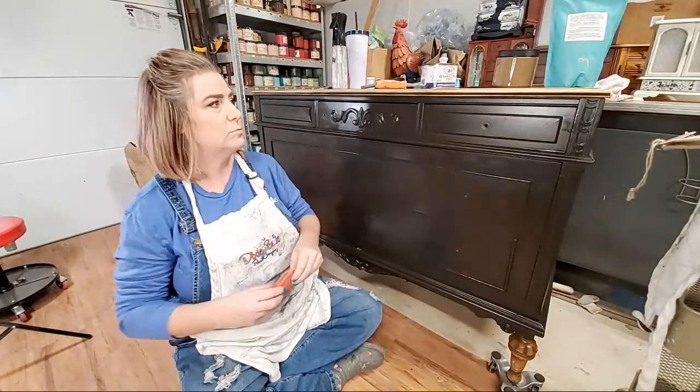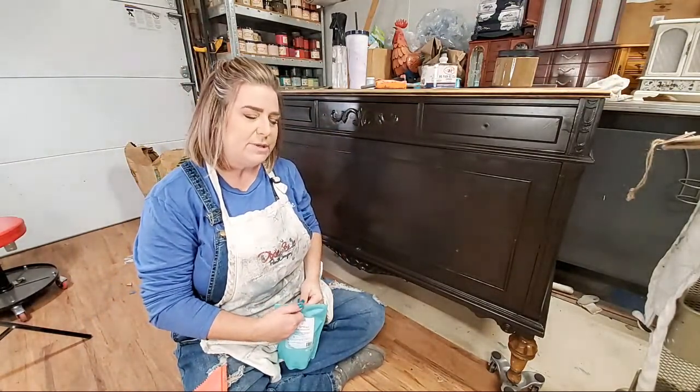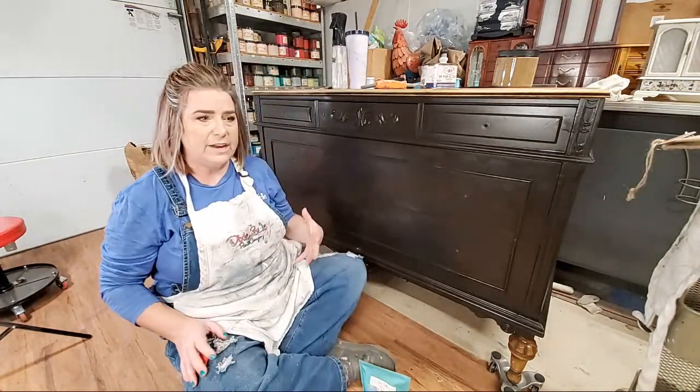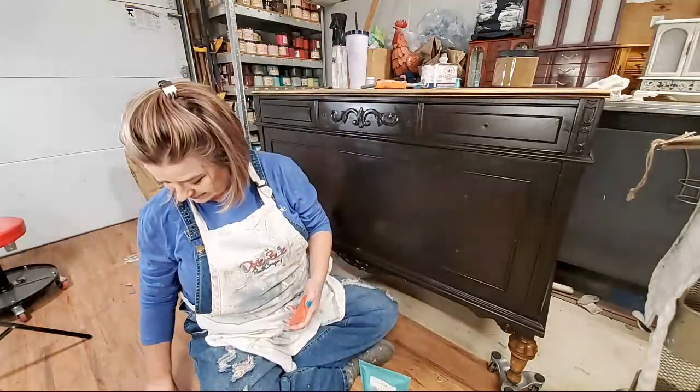So really quick, when you're dealing with your shellacs, what shade, color? So shellac dries to a clear, but it's a yellowy, amber clear. It's not a pure clear. And I just use a spray shellac. I don't like the product, guys. It's pretty nasty stuff. I only use it when I have to.